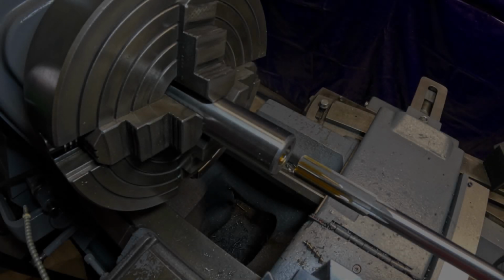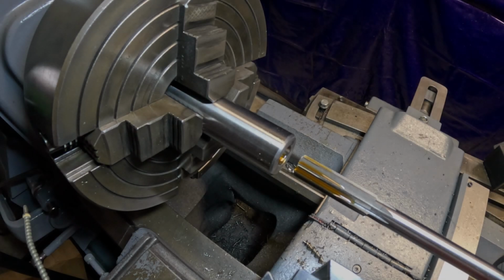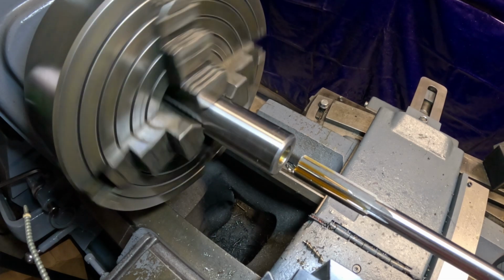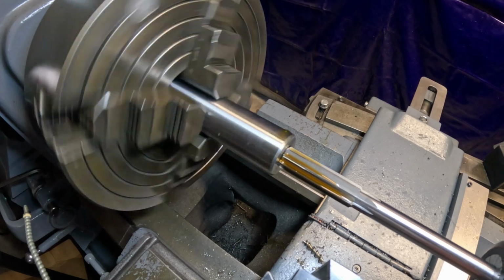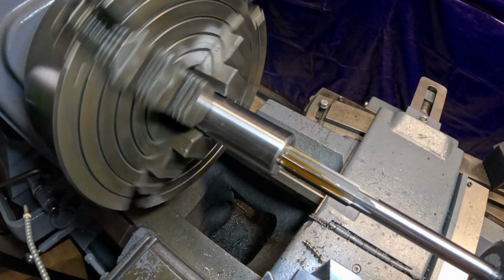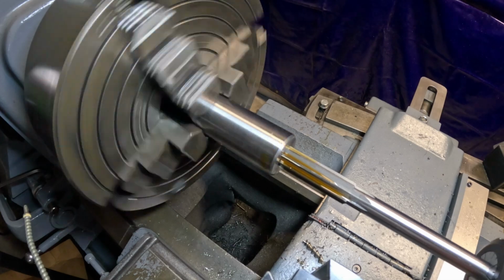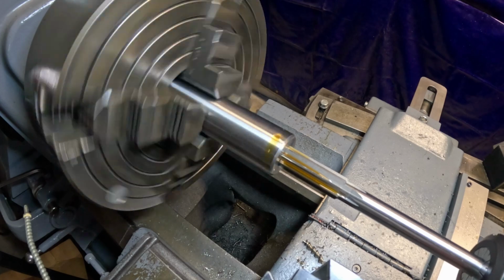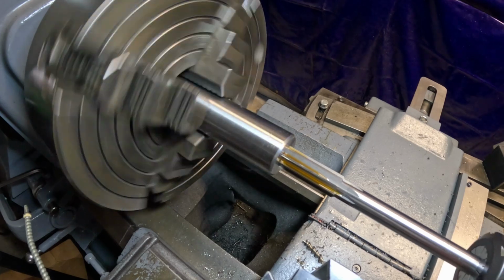All right, we're going to ream this with a 3/4 inch reamer now. My end mill is undersized a little bit. Must have been reground, so we'll ream this out with my 3/4 inch reamer I'm holding with that ER40 MT3 adapter here. It won't take much out because that reamer wasn't too much undersized, just a few thousandths.